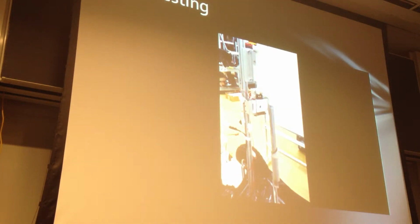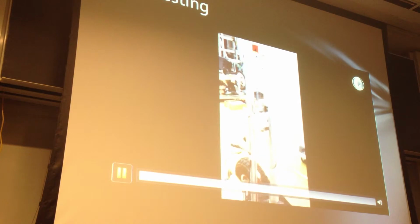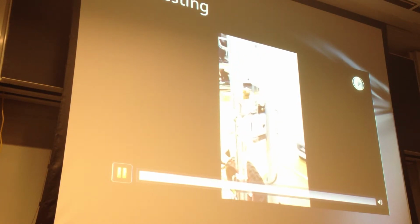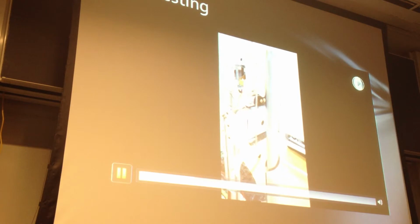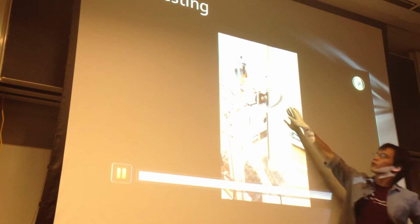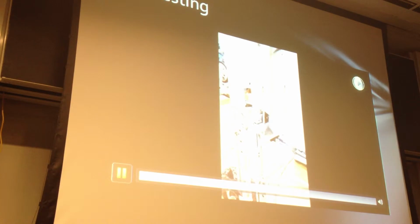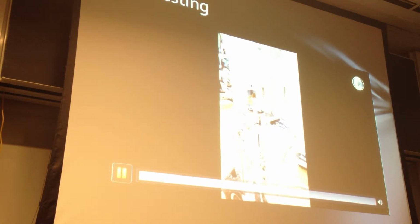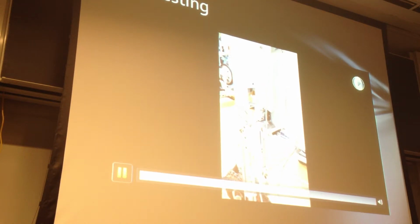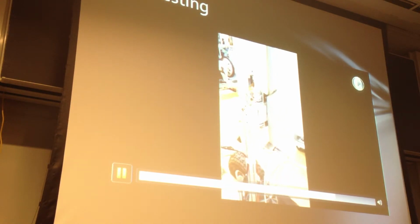In this short video, we'll demonstrate the dirty testing in the nominal configuration where Cave Crawler is flat. Similar to the roll angles, you'll see, especially on the descent, significant jerking and shaking as the regolith, especially up on the cam profile here, slides against the alignment nut. It's worth noting that it does make electrical contact with each LED, representing the induction power transfer being successful and the conduction power transfer also being successful.